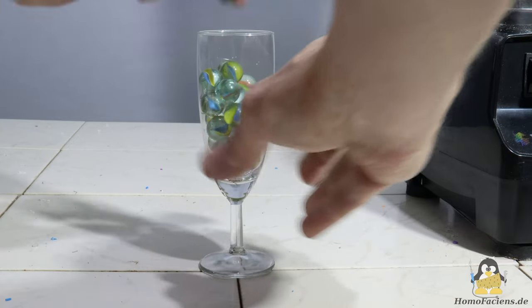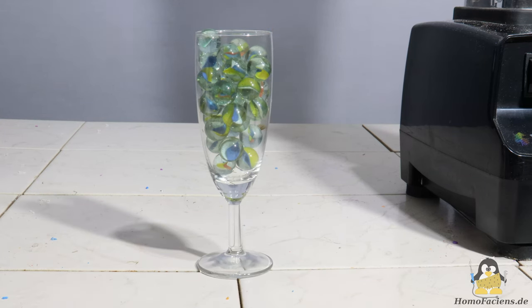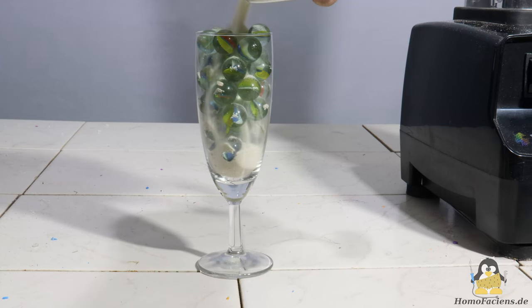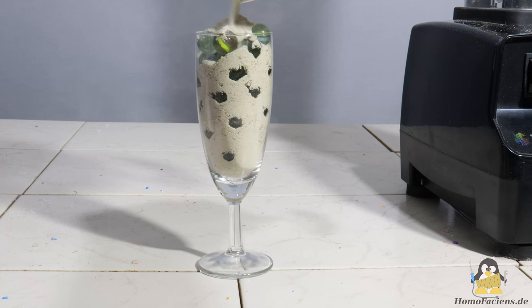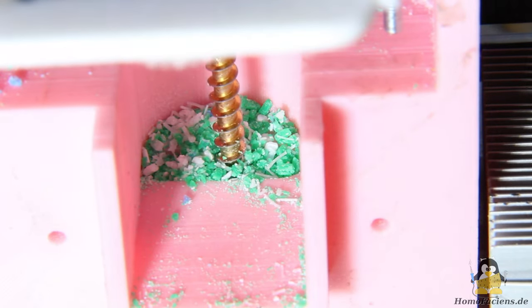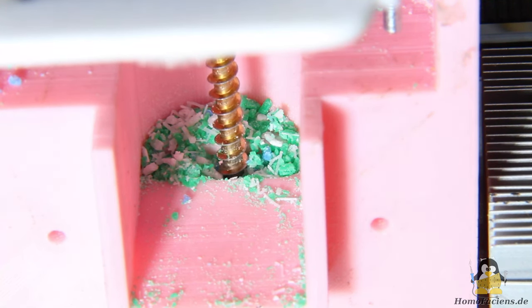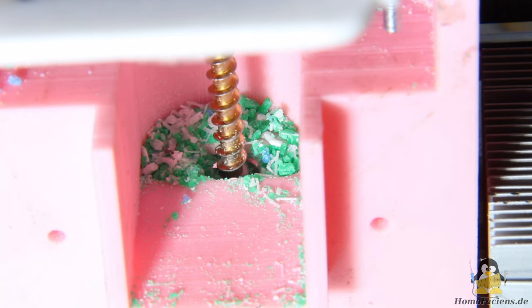The good old experiment with the question: is a glass filled with balls really full? Smaller particles still fit in and result in a higher density of the raw material for the extruder. The fact that the raw material does not consist of beautifully round balls like industrial pellets, but rather of sharp-edged chunks, makes it easier for the plastic to enter the extruder. High friction in the right place can be an advantage.